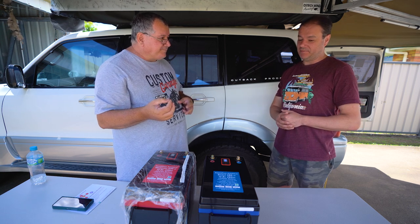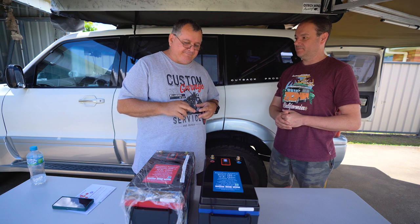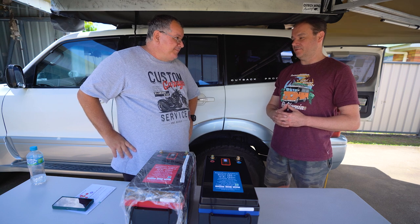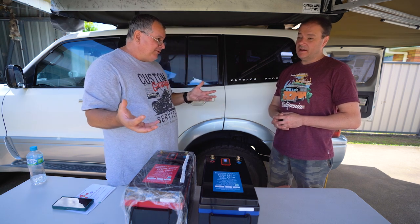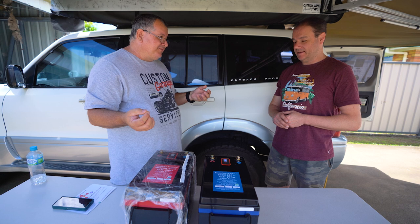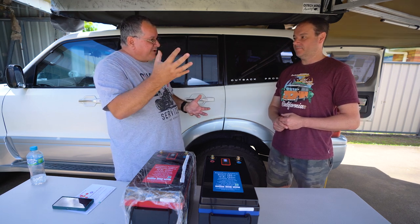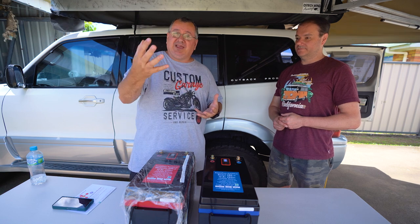It's technically a 5-amp balancer, but in most cases we find it's up to about 1.8 amps. Once the initial top balance is done — which we do when we build them — there's very little chance of it going far out of balance. Every time you fully charge it, it'll just tweak that balance a little bit. The battery will continue to balance itself even if it's stopped fully charging, even if above 14.4 volts but your charger isn't putting current in — it'll continue to do its work. What about absorption time? Around two hours would be fine.